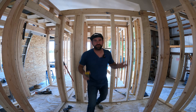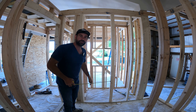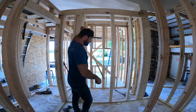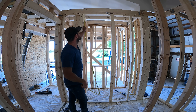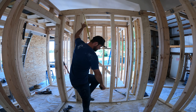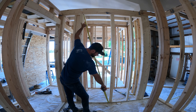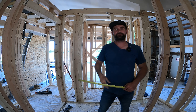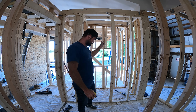I had to put a wide lens on — I know it looks like a security camera — but it was the only way to get this door frame to show up in the shot. What we're looking for here is how to know if your doors are square. Here's a freebie tape trick: move the tape, take your knee, rip it up, then push it down to extend it. Pull diagonals on the door opening — I've got 96 inches that way and 96 inches the other way. Do that to every single door opening; pulling diagonals is the easiest way to check.